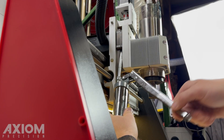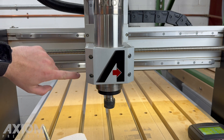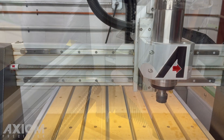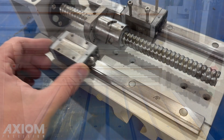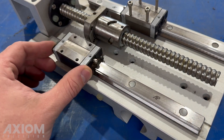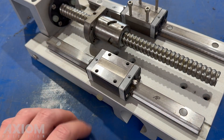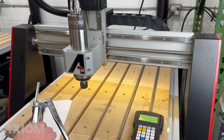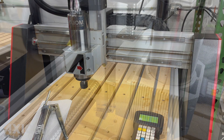In this video, we will cover how to grease the multiple bearing cars on the X, Y, and Z guide rails. The bearing cars guide along the linear rails and need to be greased every 500 machine hours. Each car has a grease fitting on one side. With the machine homed, you will need the grease gun from the maintenance kit.